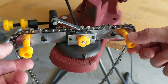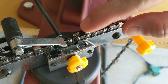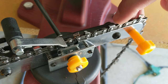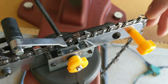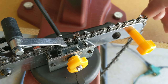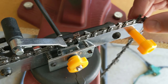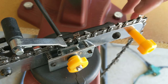You can maneuver the chain using the knobs on either side. The actual part of the chainsaw we're sharpening is this angled part right here — every other blade goes the same way, and then the ones in between go the opposite direction. It's important to figure out what angle your chainsaw blades are cutting at. These are cutting at 30 degrees, but it may not be the same for your chainsaw. Check your chainsaw manual or go online and search your model to find the correct blade angle.